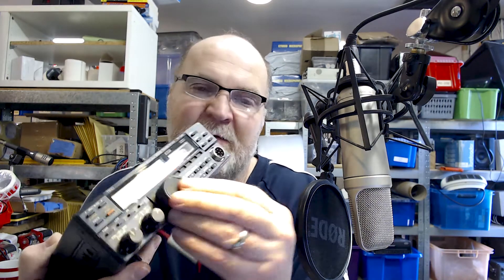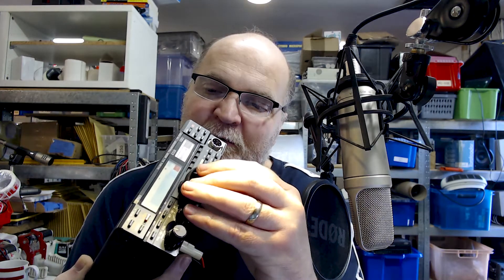The conditions are quite good right now. Two things to look out for: one is the volume and squelch knob. These are very low quality and after a while they fail to work. So if you buy one used — and you will have to buy one used — check these. If they make any noise, stay away; they will fail eventually. There is a pot in the TS-850 that can be used to replace this — I think it's 100 kilo-ohm but I'm not exactly sure. Also something minor: the little rubber ring on the VFO knob comes off, so if you go mobile, put a dab of glue on it so you don't lose it in the field.